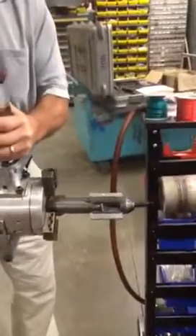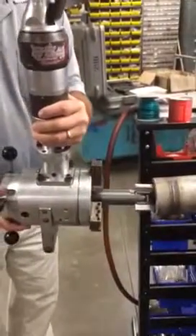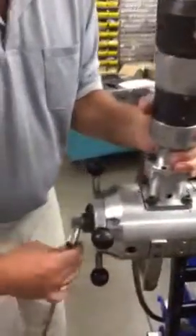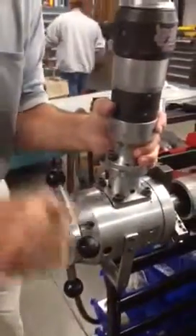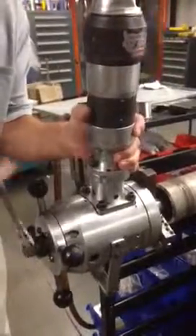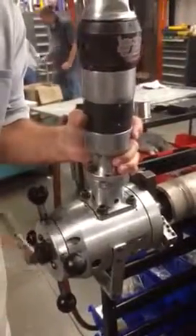Here's how the bevel tool works. Take this, put your right feet — which are here — on the end, which goes into your pipe. Take this, slide it in. Take your wrench here in the back and you're tightening this. What that's doing is the shaft's expanding inside the tube.